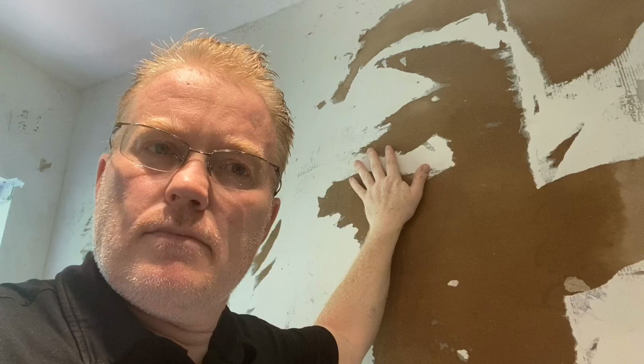That's number one. After it's sealed, then you can prime it. Let's say you're painting the wall navy blue. Prime it. It's already sealed. Now, what are you doing? You're conditioning the surface. You're covering all of the sheetrock. Everybody touches sheetrock. It's in trucks. It gets a little rain on it, right?